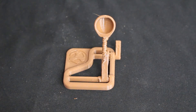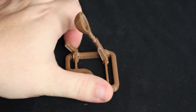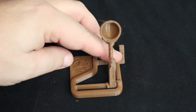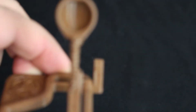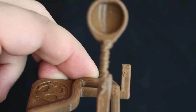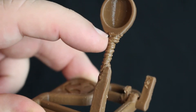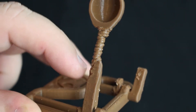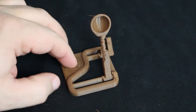Now here's the second one. As you can see on the second one, it didn't print out perfectly. It did print out and it is functional, but if you get a close-up of it, you can see the neck got overheated while it printed — the neck was too hot while printing. Now, there are ways around this: you can cool the head down a little bit, you can make it take longer to print these layers, or you could slow the print down. It would help some.